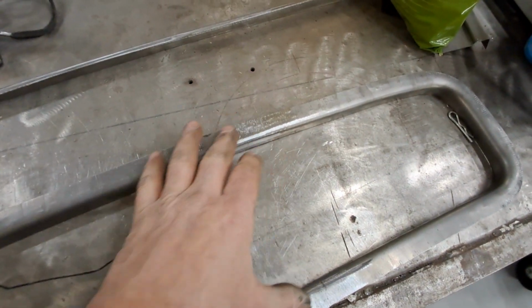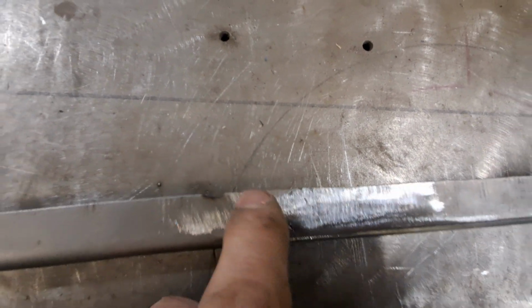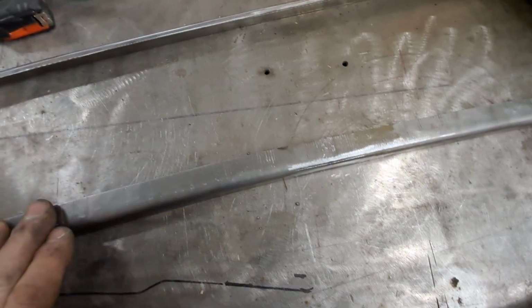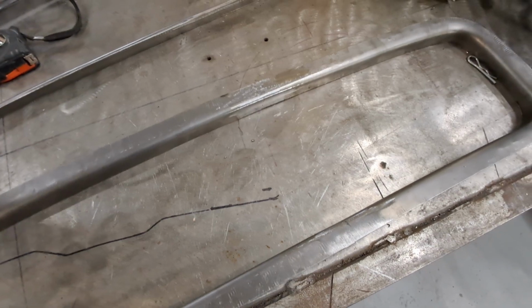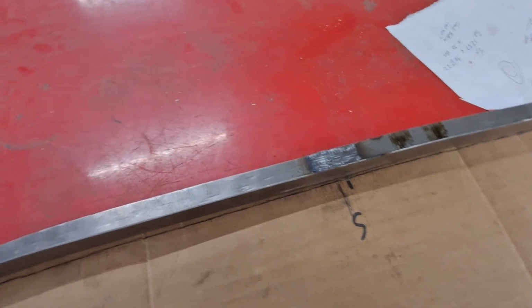All right, straight off of the weld and grind phase. These are the 2 ends that I welded together. You can actually see where the material was stretched out as I hammered it over a dolly on both sides. I concentrated on this side of the weld, just 80 grit on a Roloc, nothing special. Then I had to hit a couple of shrinks and stretches, because of course when you weld it moves material 100% of the time, not never, 100%.